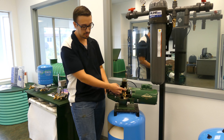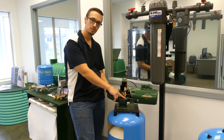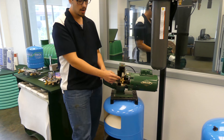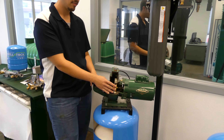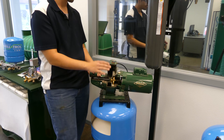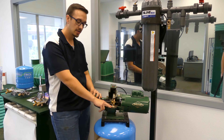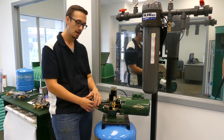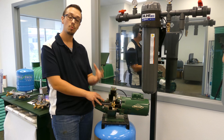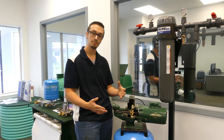You can see this white section here — this is known as a diffuser, made of glass-reinforced plastic. This pump actually has a bronze impeller, though oftentimes pumps have plastic impellers. If your pump is running dry and not fully primed, you can have impellers melt, diffusers melt, generate a lot of heat, and cause pump failure. So it's just not a good situation, and that's why having a check valve or foot valve is extremely important on your jet pump system.